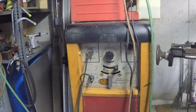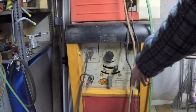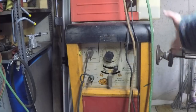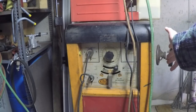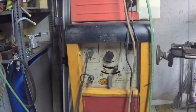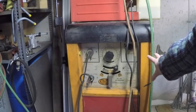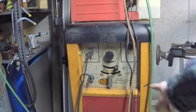Now, don't get too hung up on all of these nomenclatures on the end there. If you want to spend hours finding information for this welder, just simply put in an Airco Model 3A and let your fingers do the walking. But essentially, in its many different variations, this is a Miller 330 A/B/P, I think is the Miller number. You can see this same exact welder in the Miller colors of blue. So this was made by Miller, but marketed under the Airco name at the time.